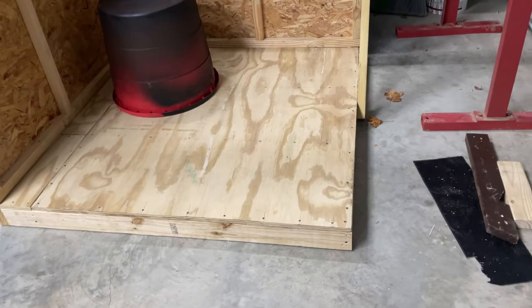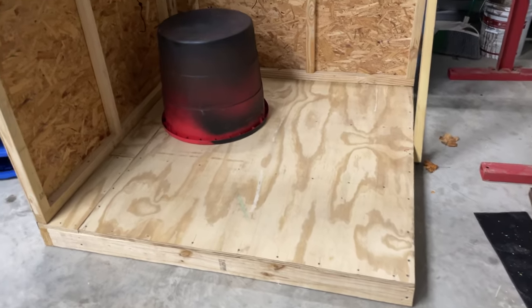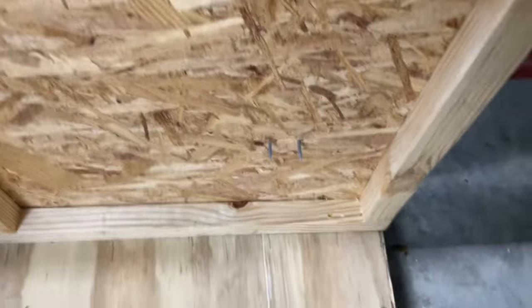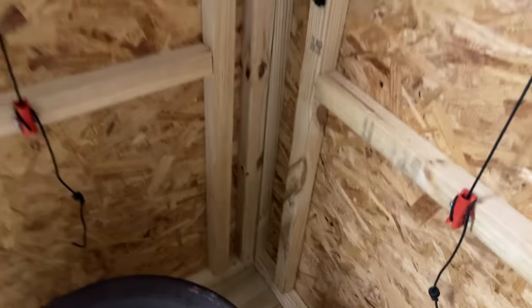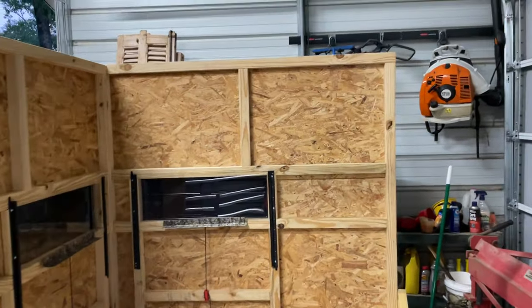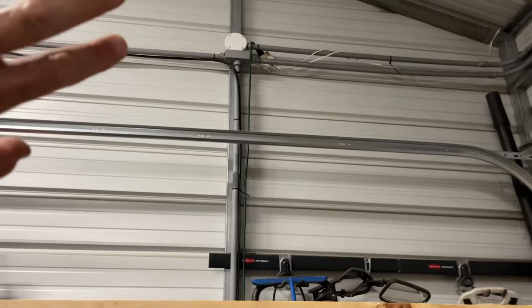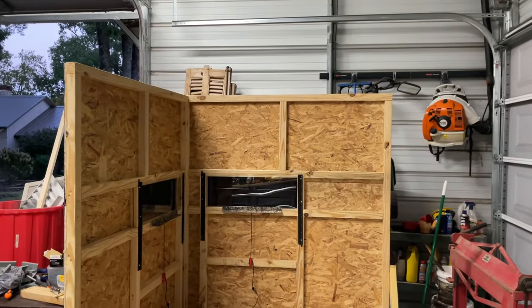Basically I built a floor - whatever width you want - I frame it heavy, usually use three-quarter inch treated and two-by-fours on the floor. Then for the walls, when I build them I put just one, two, three screws in the bottom, and probably three screws into each side. Once you get these four walls up and tied in, my roof is made so that after the third wall is up we actually set the roof up on top and out of the way, then put the door wall on, and slide the roof into place.